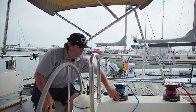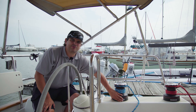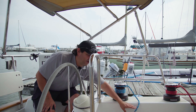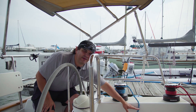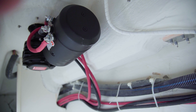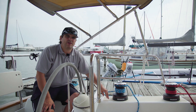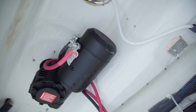To help with finding room for the motor and gearbox below, there are two options: a vertical motor that runs straight down, and a horizontal mounted motor which saves vertical room but takes up more length. This boat went with horizontal motors, as there's room inside the combing wall for them and you don't lose much vertical room below.